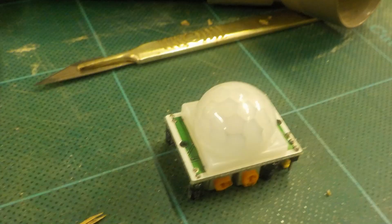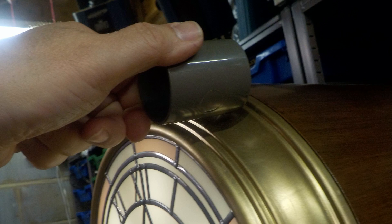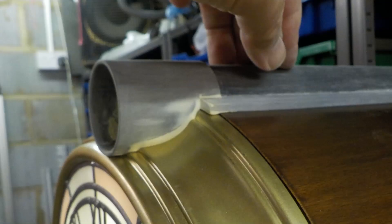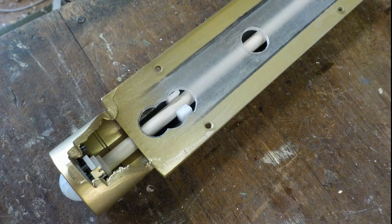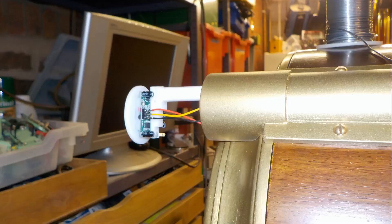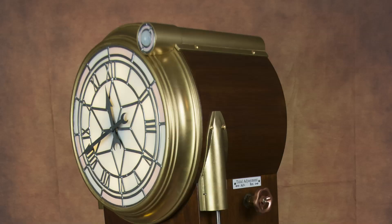Another extra bit I had to add, which I hadn't planned to but was very pleased when I came up with the idea, was a PIR sensor, which would mean that if it didn't see any movement for an hour, it would then switch off and shut down — basically keep going in the background, but save on all the mechanics, mechanisms, and motors. The lovely thing about having a PIR sensor is that when it first sees movement — when you come back and it sees you move in front of it — it can then start up and respond by moving and making noises. I didn't have anywhere to fix one, so in the end I built an extra bit out of some plumbing pipe and fixed it on the top, offset, and it just looked really nice.